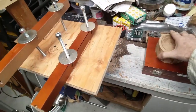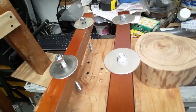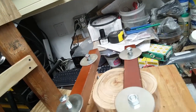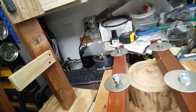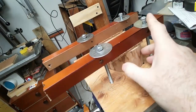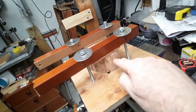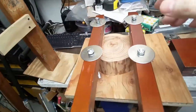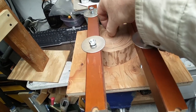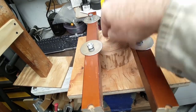So if I take this and set it up here — I don't know if I can do this with one hand, but we're going to try. Put that up the whole way; that will fit under. I don't know if it's going to clamp firmly enough, but I did put some cork under there so that when it pulls down it shouldn't cause problems with the wood. I'm not sure it's going to hold it sufficiently for Forstner bit work, but we're going to try. I'll at least be able to use that for the short one.